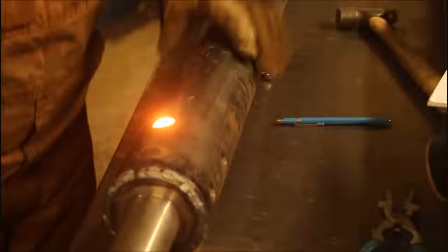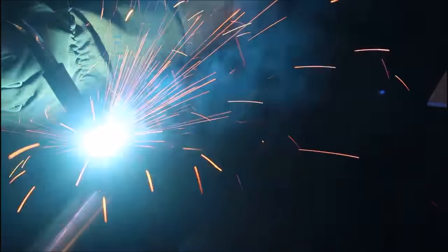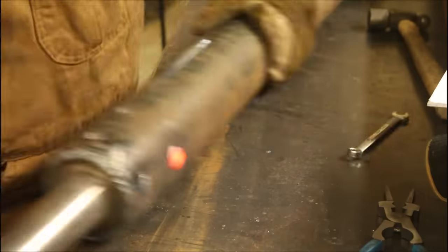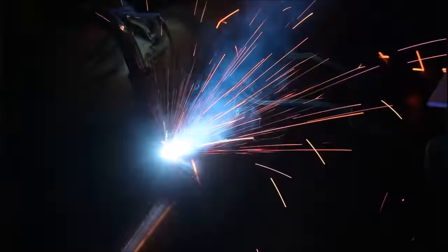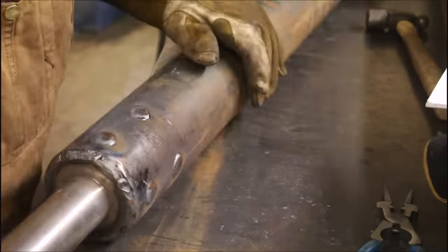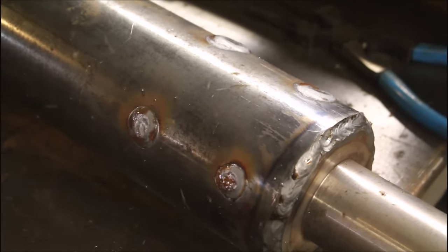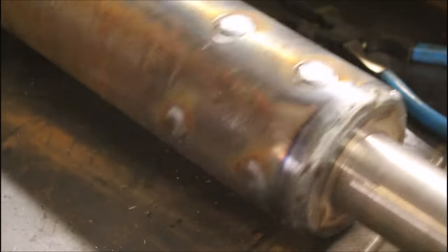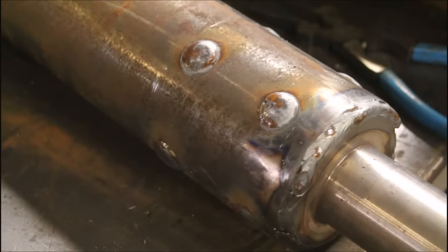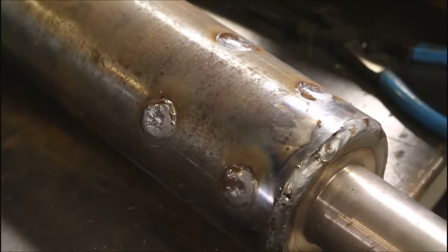Filling the holes. You need to start at the bottom and make little circles all the way out to the top until you're completely full. You want to do this without stopping — all in one weld. That just gives you better penetration and better appearance. All ready to go; we just have to clean that up before we paint. The whole thing needs to be cleaned up before paint. They turned out pretty good — just how I wanted them.